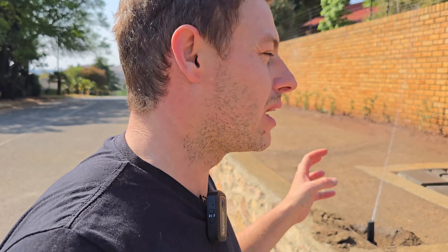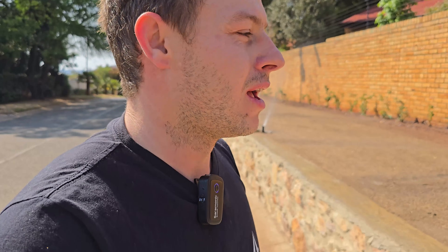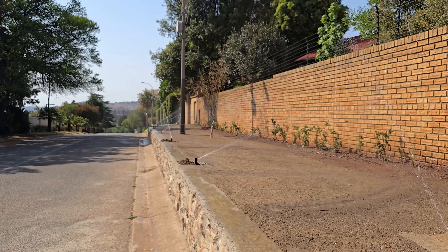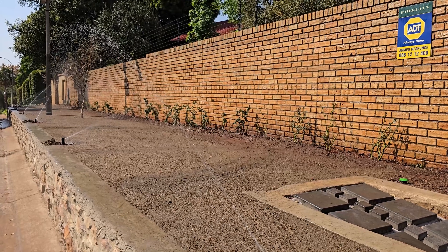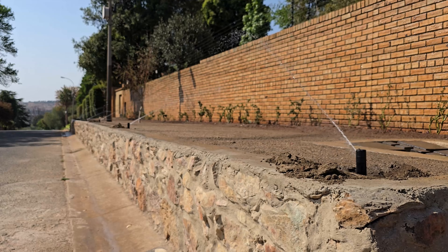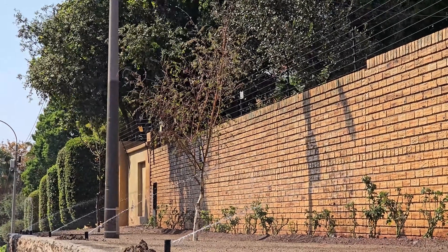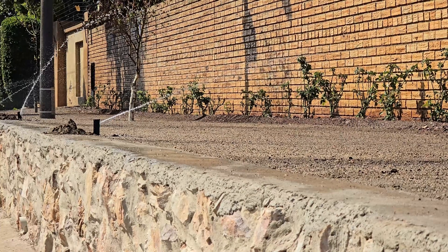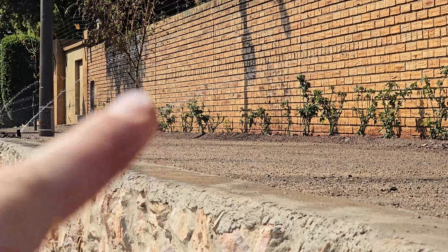You can really play around with adjustments to suit your available pressure. If you've got too little pressure — probably the main problem people face — revert to smaller nozzle sizes, go to the smallest if needed. I could obviously go to half the flow rate in the middle still, to build that pressure back up, though it will hinder overall uniformity. To demonstrate a poor pressure scenario: with less pressure the sprinkler loses its ability to properly break up water droplets, shooting all the water to the end of its arc instead of evenly watering everything in between.